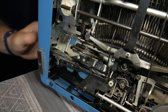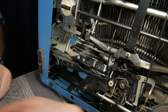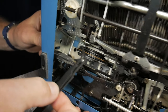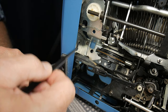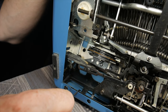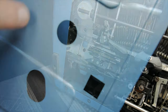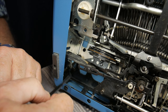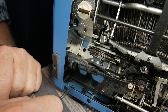Something else to take note of in here is that there's no sound insulation on the inside of these metal panels anywhere. In the sides, there's hardly any room for insulation. You would think there would be, as wide as that panel is. But the articulating spring-loaded mechanism for the ribbon cover just takes up a lot of room in there, especially when you're trying to get the chassis out. So no sound insulation at all on this metal-bodied typewriter, not even on the bottom of the panel. Maybe in the future I could try to add a little bit of felt in there to try to dampen some of the sound. Even the underneath side of the ribbon cover might use some sound insulation — it goes a long way toward making it a little rattly sounding.